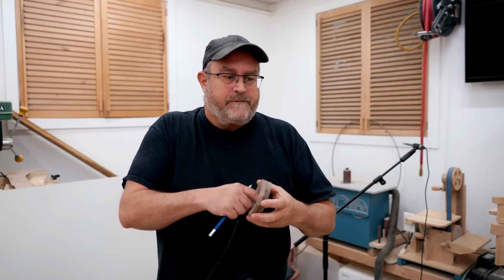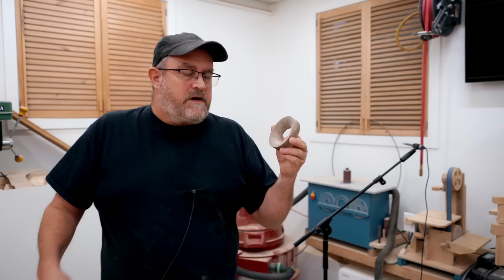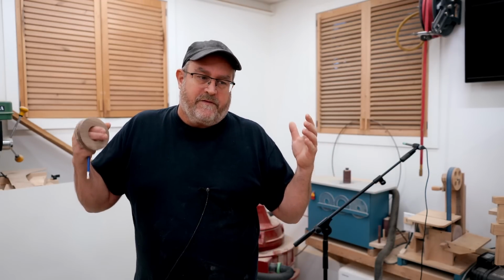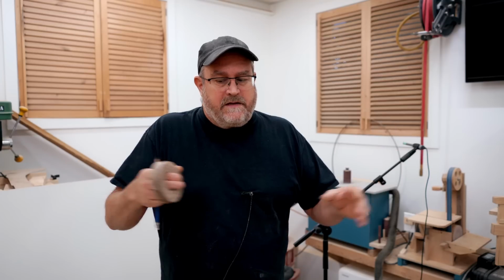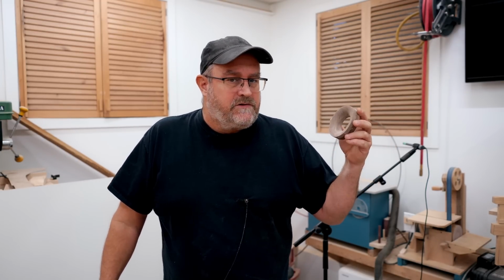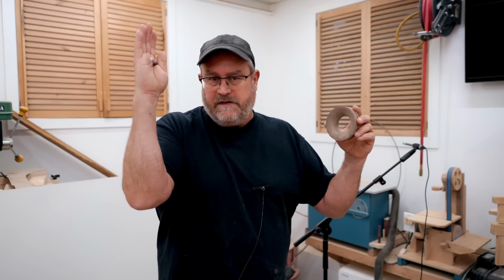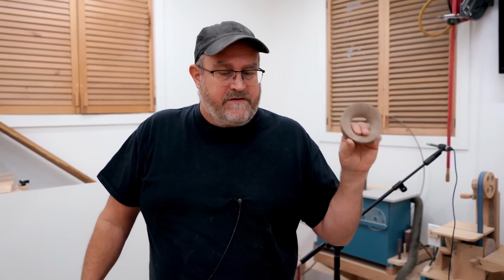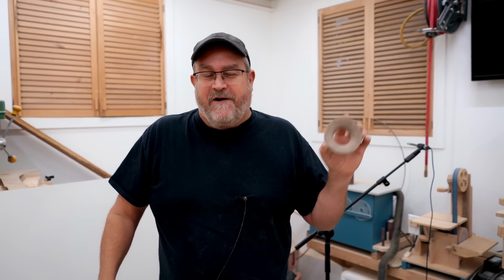What I'm going to show you in this video is actually testing what this does to the tweeter. There's one primary reason why I'm using this and not just putting the tweeter in the front. From my testing in the basement, it would actually work better if I just mounted it flush on the front. But by doing this, I get some time alignment correction. Even though I have that ability in DSP, I'd still rather do it physically if I can, like move the tweeter back. Also, the speaker itself tilts back about 2 degrees. What this does is it makes the tweeter more efficient, except it only works in a certain range. And I want to see how this particular shape works for the tweeter that I have.